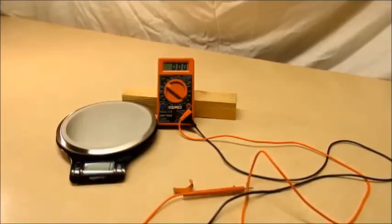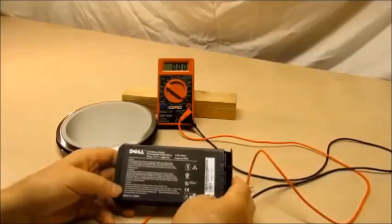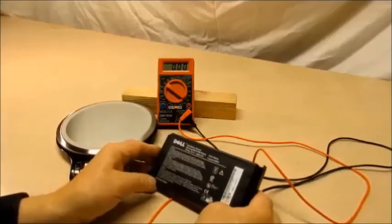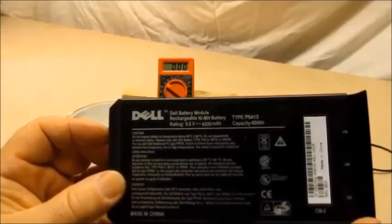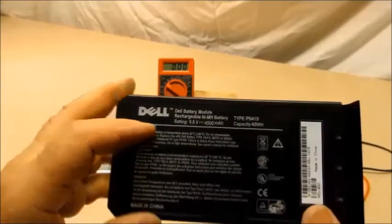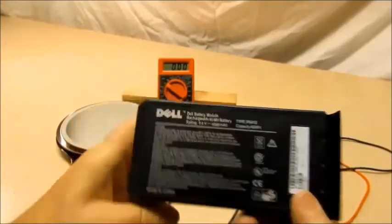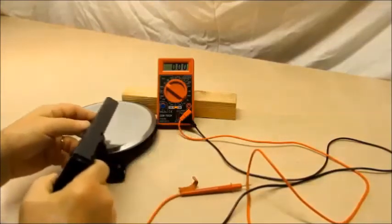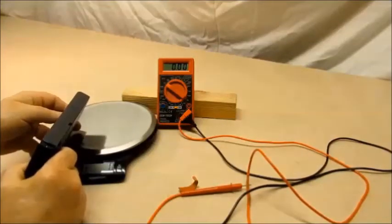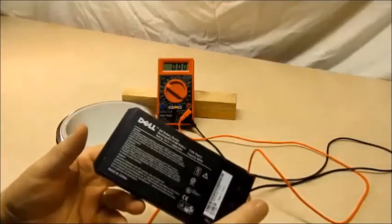In this case there are a ton of Dells that have the 18650 cells in them, but if you look really close it says 'nickel metal hydride battery' — NiMH battery. Obviously that's not good for what we're trying to do, so that has to go back — not because it could be good or bad, but it's just not what we're using.